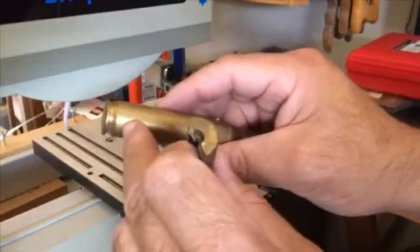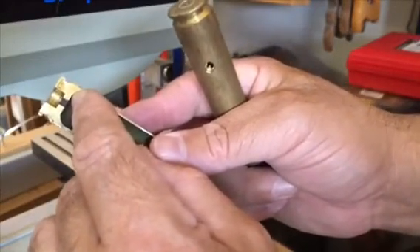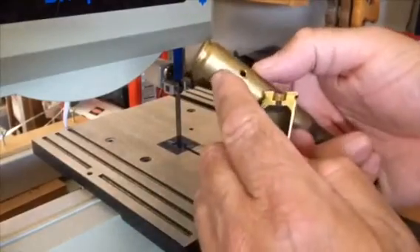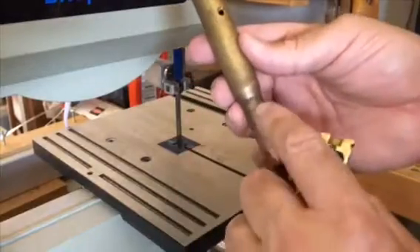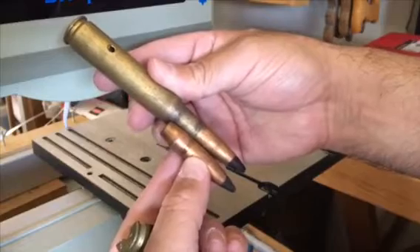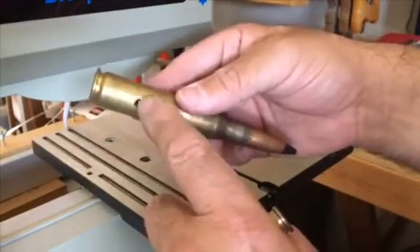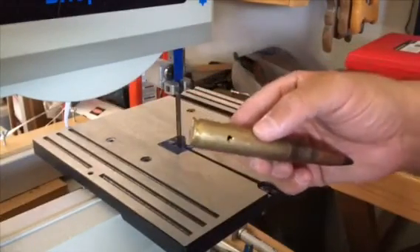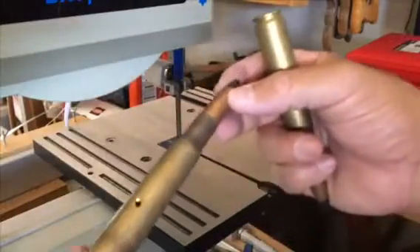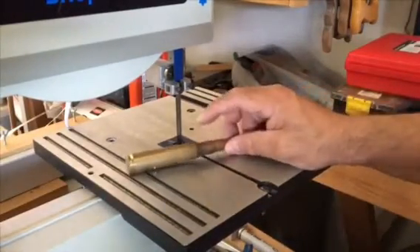On the inside it's really thick, so there's less machining to do. I go about an eighth of an inch below that line, and I can cut the back off. On the tip side, it goes in about this far, so as long as I cut about halfway from the neck, I don't have to work it loose with pliers. You can see this is a dummy round — they're all drilled out. I bought these at my local military surplus store in Hesperia, California, near Victorville. They're $10 each. I've got my safety glasses on and I'm going to go ahead and cut this part off first.